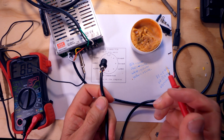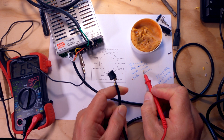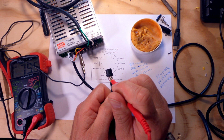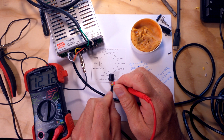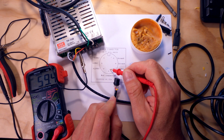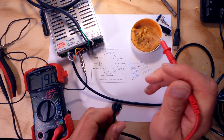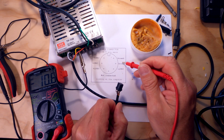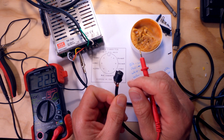Now, we didn't move our yellow wire, so that's going to obviously be our 5 volts. Now, our white wire is going to be plus 12 volts on the right connector on the pin, which is the third one down from the left. Let me get this where you can see it in focus here. And there we go, plus 12 volts. That's what we want. And going down in the center pin, we're not using that one, which was this one right here. That one's not connected. And then wrap around over here to the red, which is going to be our minus 12. And it is. And then all the way up over here, which is ground, which we know is ground, is going to be 0. All right.